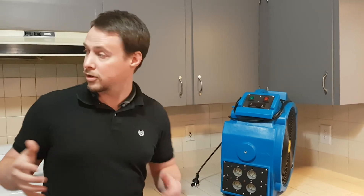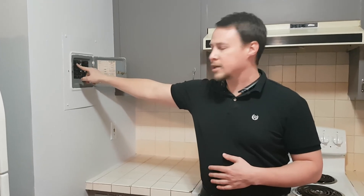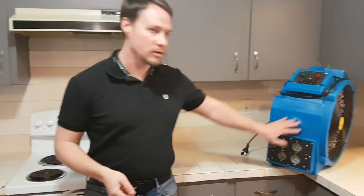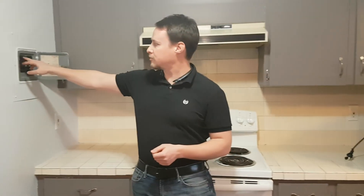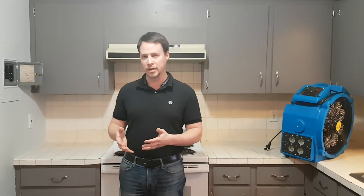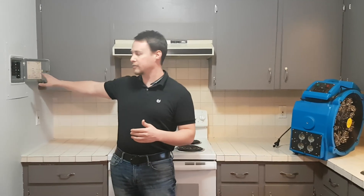So let's say I've got breaker number one — den and lights. Because this is a 20 amp breaker, I wouldn't be able to plug two extension cords that go into my heater into the den. I would need to come down and find an additional breaker to plug into. So for example, my second one down here on the left is the dining room outlet. So I would take one extension cord, plug it into the den, and the next extension cord I plug into the dining room outlet. So take a little bit of time to look at your breaker box, figure out what goes to where, and if you don't have anything labeled or things are mislabeled, don't worry. We're going to talk about that in the next video when I show you how to label them if they're not correctly labeled or if you don't have a breaker map like this unit does.